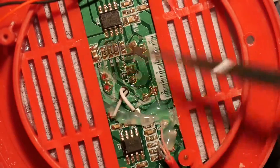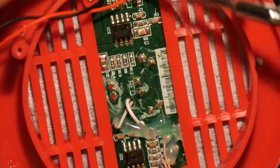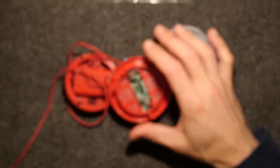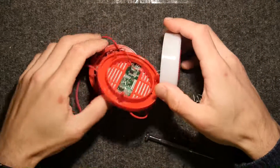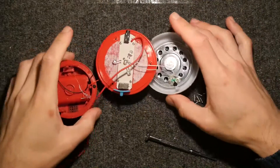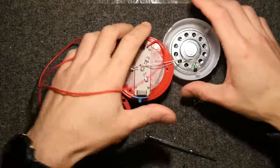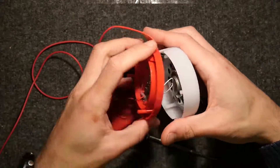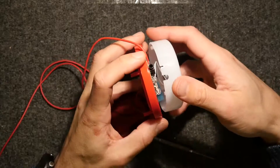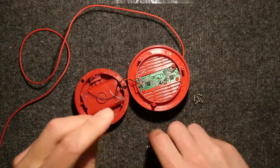And that's all there is to it, really. Power comes in to the switch, powers up the audio amplifier - so that's always running - and then the light show is the optional part. Hope that's saved you having to open up your Pringles speaker. Something you might like to do now that we've actually opened this up and you can see how it's made is you could quite easily transpose this into your own enclosure. If you've got any projects that require an amplifier, speaker, and even LEDs, you've got your options here - just move the whole lot, wire it up internally, do a systems engineering job. It's all finished for the price of a couple of packs of Pringles.